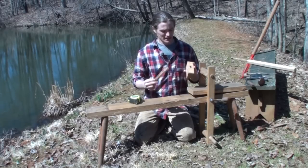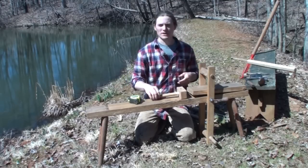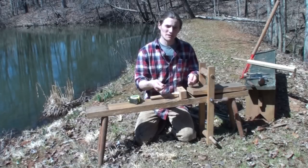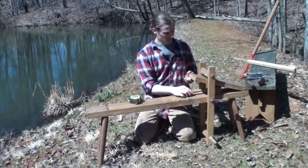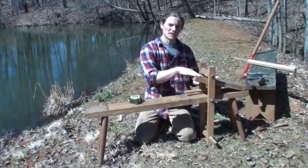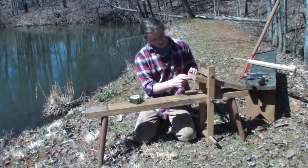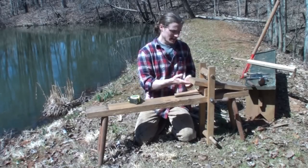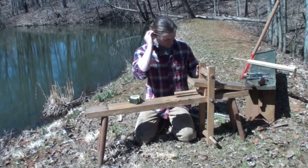That board trick is something I wasn't sure I'd use much, but it turned out I switch back and forth on it a lot, especially when working tapered pieces — as you bring from the fatter end toward the skinnier end, you need to adjust the ramp. With a thinner block shoved in far enough, the ramp can overhang a lot, and even at about an inch and a half thick there can be some flex. A thicker block keeps the clamping jaw closer, which is stiffer and nicer.